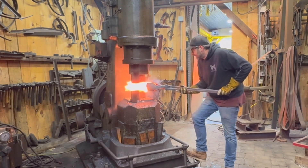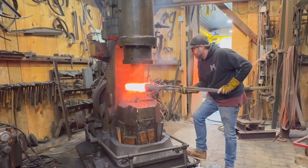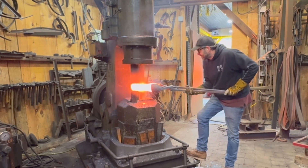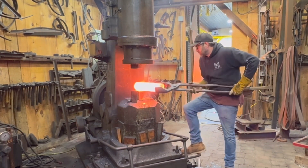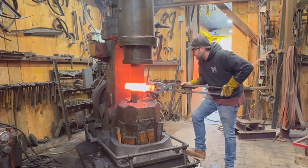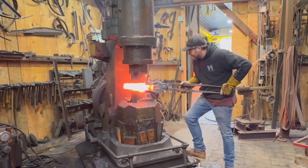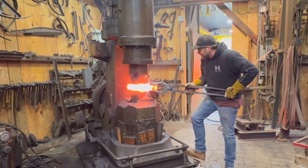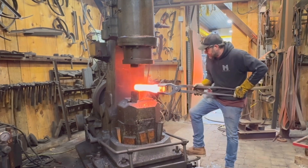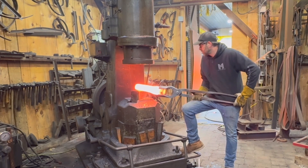This hammer is mounted on a temporary base — a steel plate. I'm 6'4", fairly tall, but even for me this hammer is a little bit high. I'd like to see the center of the reins of the tongs down at about belt level — four to six inches lower — so that you can push down on them as you're forging.